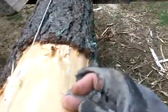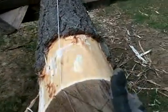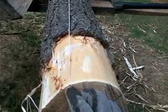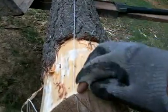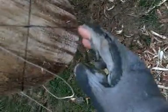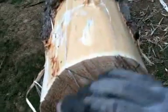When you cut this notch and that notch out there, this rounded part of the wood is going to set down in between your posts. So what you need to do — I peeled it and I turned it up. This is the section I'm going to cut off the log here. You want to make sure that this point and that point coincide with each other. All I do is took an axe and cut in there a little bit, pulled the string line down into it, done the same thing. You just mark your line — it'd be better if you had a chalk line, but I don't have a chalk line here. Then you'll do the same thing with this point right here. You'll measure in your depth if you want it to rest on the post, and then mark it around here like this and you cut into it.